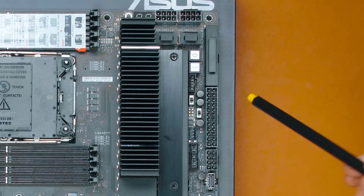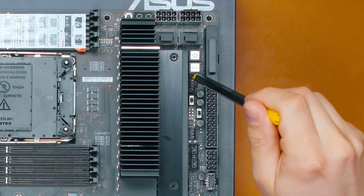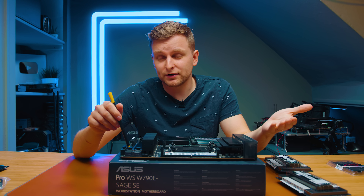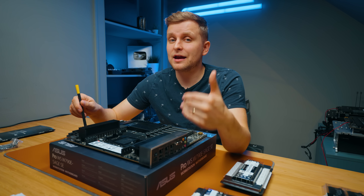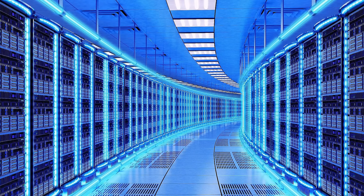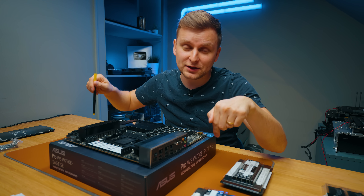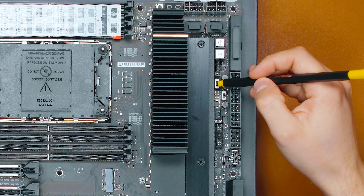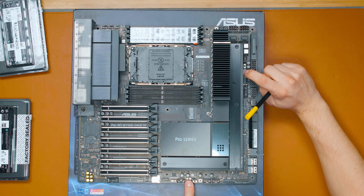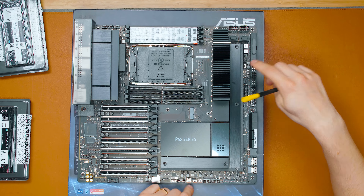There's a power-on button and reset button. There's a PSU plug to configure and adjust digital power of the PSU if it supports that. There are also a lot of headers that you might not know what they do — if you don't know, you probably don't need them. But many people working in high-end server farms and commercial environments need all of these. There's an IPMI switch, PSU switch one and PSU switch two, which let you change some of the bus settings depending on the location of your dual power supplies.